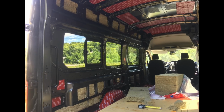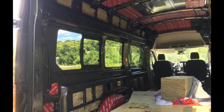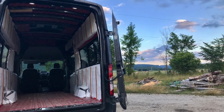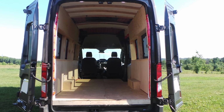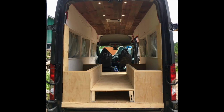So we have two insulations. We have foam board on the ceiling and foam board on the floor, and then all the wall cavities are filled with Roxul Comfort Batt insulation. We have a Reflectix vapor barrier, which is also good for the sun, and it's a good vapor barrier if it's all installed properly and taped up. We have that on top of that, and then a bunch of furring strips that have the air gaps and stuff that they recommend.